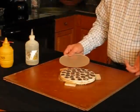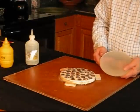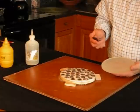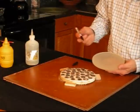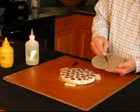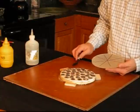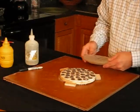The first thing before you start, though, is to be sure that your part is spherical. Hopefully you've taken care of that in generating. But if you're not sure, one thing you can do to check is the pencil test or magic marker test — just make some marks across your mirror or lens before you start grinding and make sure it cleans up evenly.